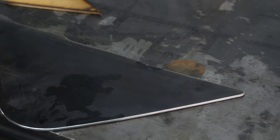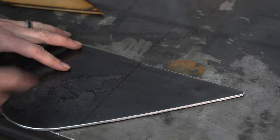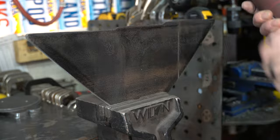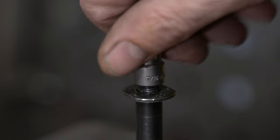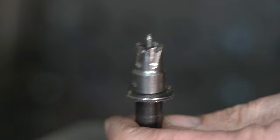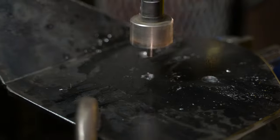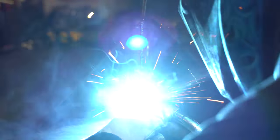I marked both places where this plate is going to bend, and I probably should have only marked one so I don't get confused. This piece needs to bend down, so it needs to be scored on this side — I'll leave that one there. The other one needs to go the other way, so I'm going to get rid of this mark so I don't make any mistakes, and then remark it on the other side. So this plate gets scored here and here.